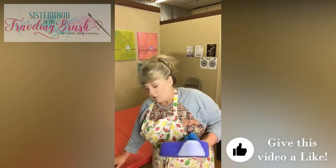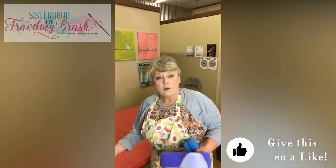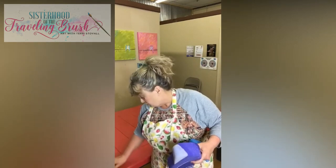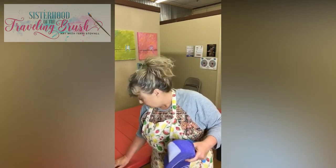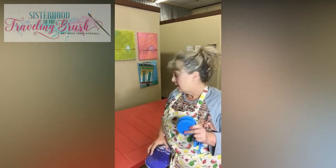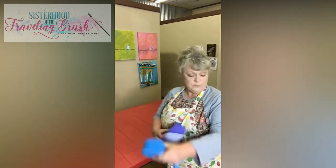Applying with the brush leaves a little bit of brush marks. On your final finish you don't want a whole lot of brush marks, but I wanted a few in the beginning because I'm going to age this a little with some dark waxes later on. I wanted a little bit of ridges in there to grab the darker color I'm going to use over it. For the remaining coats, I'm going to use this sponge.